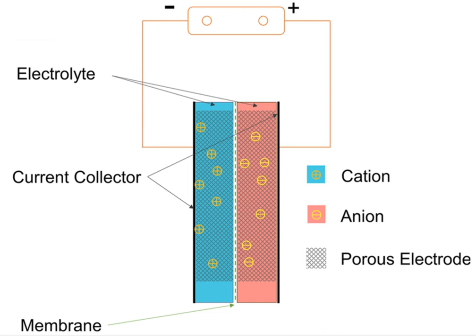Because of the very strong frequency dependence of the capacitance, this electrical parameter has to be measured with a special constant current charge and discharge measurement, defined in IEC standards 62391-1 and -2. Measurement starts with charging the capacitor. The voltage has to be applied, and after the constant current, constant voltage power supply has achieved the rated voltage, the capacitor has to be charged for 30 minutes.